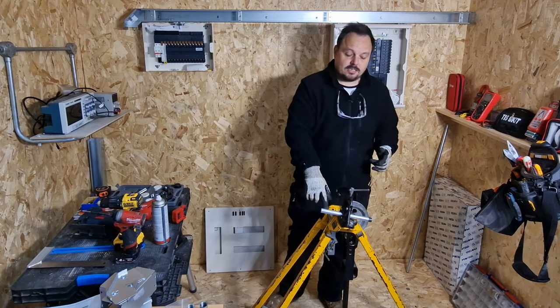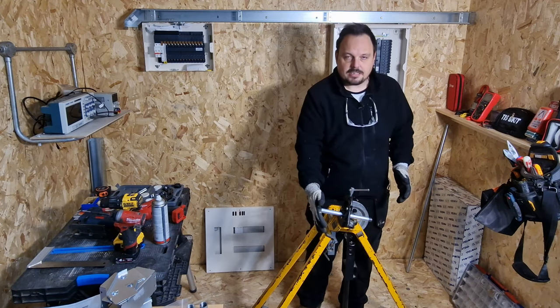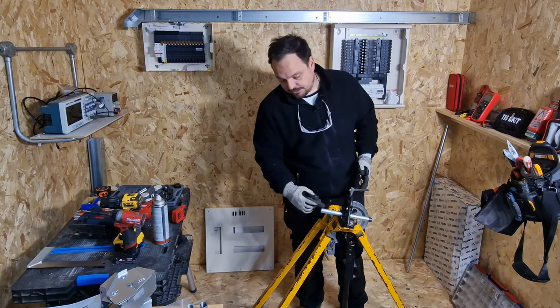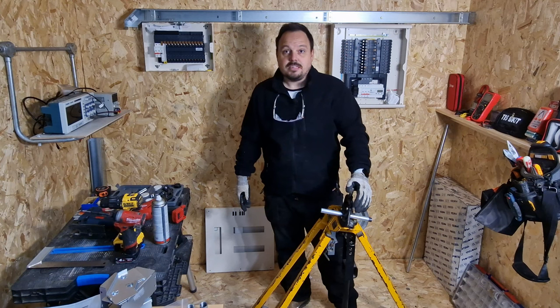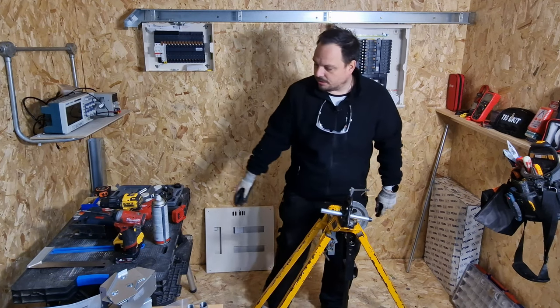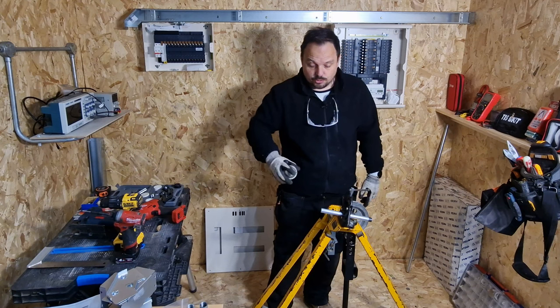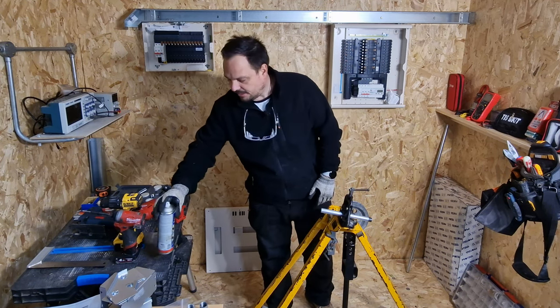We're back in the vise now. I've pulled it through a little bit further because we're going to cut the thread onto this end first. I've just reamed the sharp pieces off the inside - it doesn't really matter too much because you're going to be using the threading tool anyway, but it's always best to make sure you've got a nice square end with no sharp bits sticking out. You want some cutting compound - plenty of it, because it enables the tools to last a lot longer - so a nice liberal application of that onto the end.